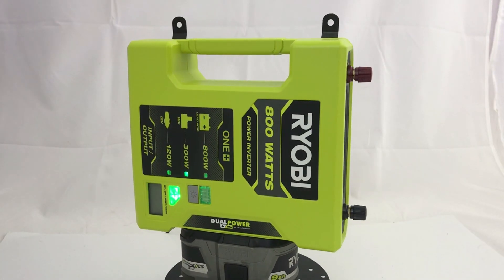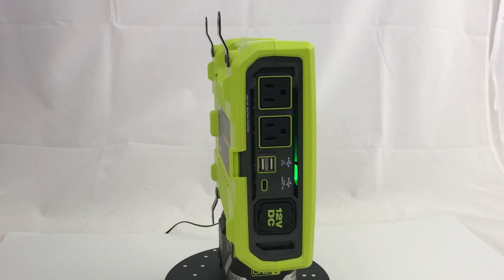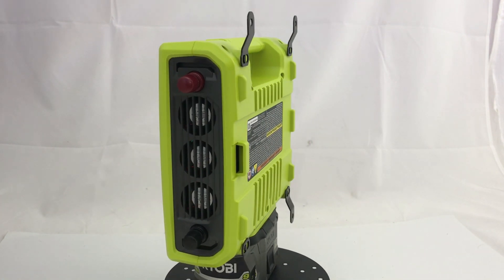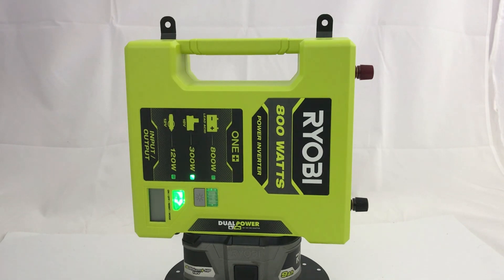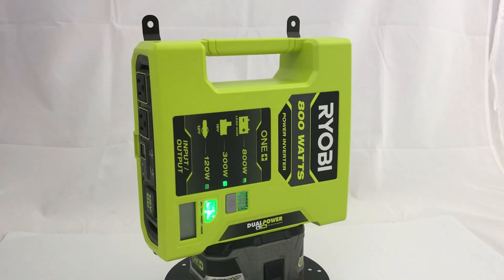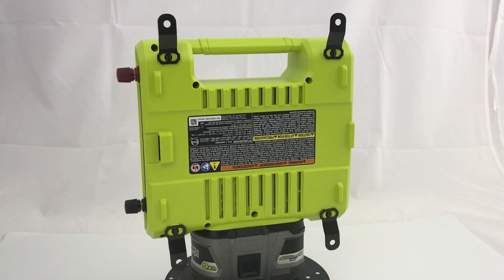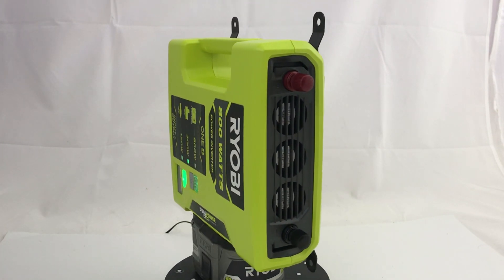So what do I love about this? We finally have a Ryobi product that can take 18 volt batteries and produce 12 volts at a cigarette lighter socket, so you can run your freezer, your CPAP, and other things. It's got nice mounting clips, and because of the 12 volt battery option you can have compatibility with solar panels and MPPT chargers. What I don't like: it's a modified sine wave inverter and I can only get 750 watts out of it, and the DC watt meter was pretty flaky. What would I improve? I'd make it a 1000 watt inverter so I could run my microwave and air conditioner in my trailer, add separate on/off switches for the DC and AC, and it would be great if it had solar charging for the 18 volt battery. If this information was helpful, please hit like and subscribe and have a great day.